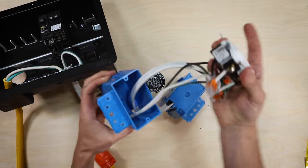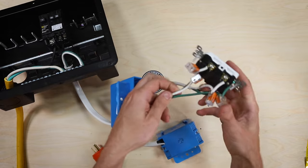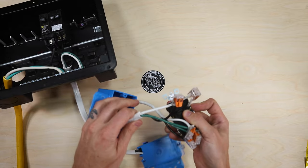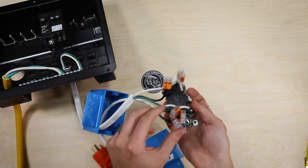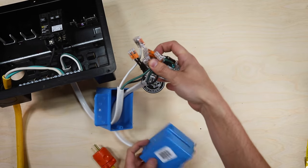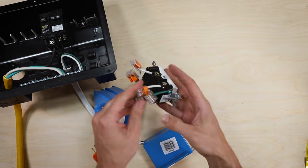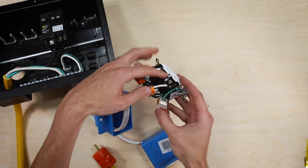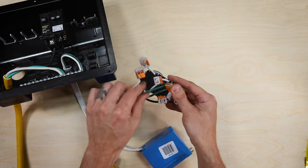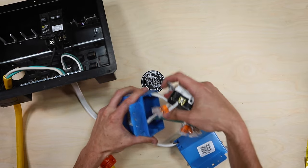This is all wired up — it gets pretty messy in a hurry. The wire coming from the breaker box connects to 'line' — our positive and neutral coming from the breaker box — and then 'load' is coming out of the bottom two screws going on to the next outlet. This GFCI outlet is protecting that downstream outlet. All the grounds just get tied together in the same lever nut — ground screw from the GFCI, ground wire coming in from the breaker box, and ground wire going out to the secondary outlet. Let's put this back into the box and give it a test.